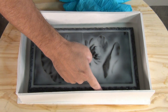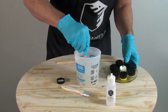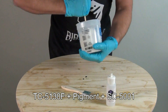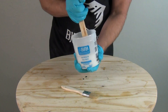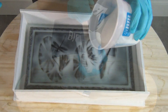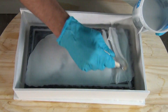About 30 minutes later, don't touch the surface of your part to check — check the inside of the mixing cup or sides of the mold box instead. With 5130F you can typically apply a layer about every 20 to 30 minutes at room temperature. The second batch is TC-5130F plus pigment plus a small amount of SC-5001 — about 400 grams with maybe a gram or two of thickener. We want a light paste consistency that still runs a little on the surface to capture detail but stays up on the sides better.